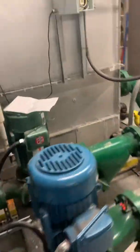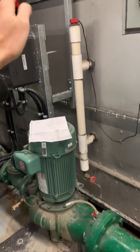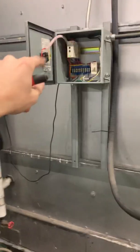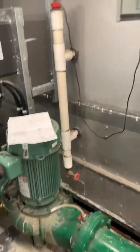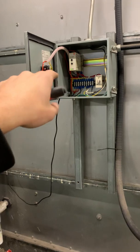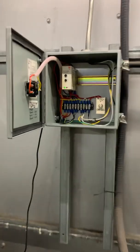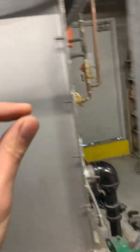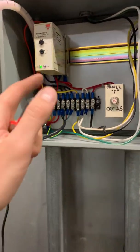This is the new water conductivity sensor system for filling. We have three probes that go down: a grounding probe, a low water level probe, and a max water level probe, plus a relay that turns on the water fill valve. I noticed it was filling when the green light was on. If it's in auto and the green light is on, the contacts are open. When the green light stays on and the red light comes on, the contacts close and the water fill valve should come on. That led me to think the contacts were welded — I pulled it apart and verified the contacts were indeed welded.